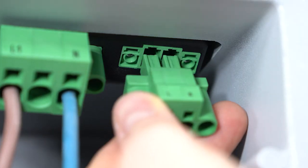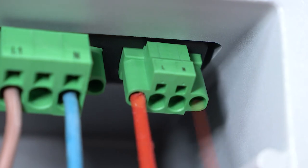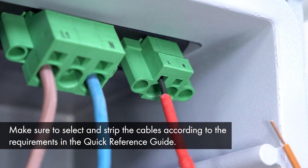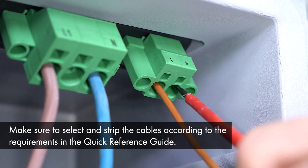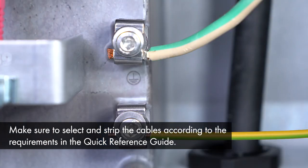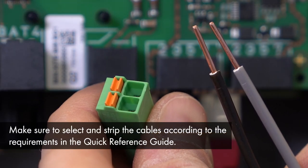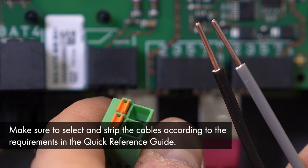Also here, connect the AC secure power supply plug to the inverter first. It should be tightened with a 3.5 mm flat head screwdriver. The grounding conductor must be connected to an equipment grounding terminal as well. The plug that's connected to the switch is still missing, so connect it to the inverter at the communication assembly. Make sure you hear an audible click when connecting it to ensure it's properly installed.